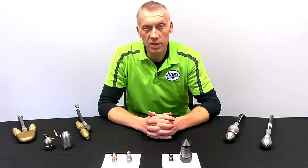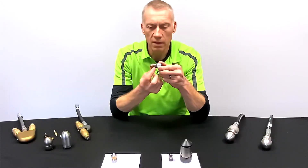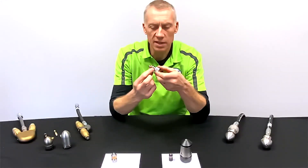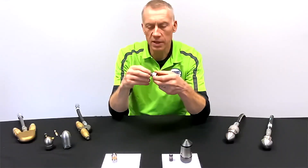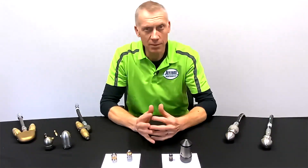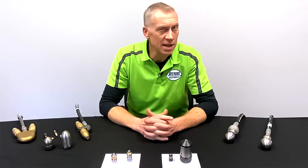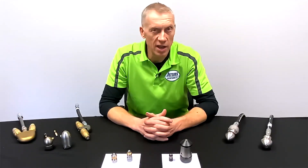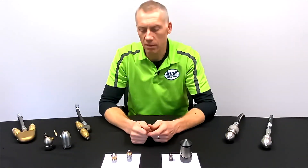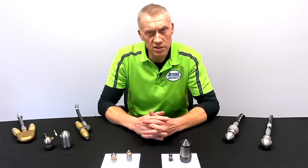For the different types, let's start with the oldest: the high-speed spinner. You've got a center barrel in the middle that rotates, with a couple of jets coming out. As that center barrel spins, those water jets are spinning. These high-speed ones are real distinct from the sound they make — very high-pitched. The faster you rotate a jet, the less impact it has, and it can actually bend the water jet as it's being dragged across the pipe wall. But they're inexpensive, so these are great for soft grease, soft sludge — and there are different grades to these.